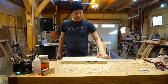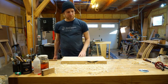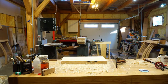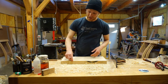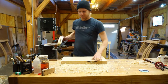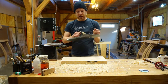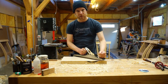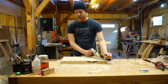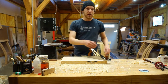So there, we've got this to where it's flat almost entirely from edge to edge — just a little bit of that cup left in the middle, and a lot of that will even get taken out in our next step. Now that I've dealt with the cup, I want to deal with any twist in this board. The way we deal with twist in the surface is we take a nice long plane that's going to average this corner to this corner, and this corner to this corner, all the way across the board to take out any twist.